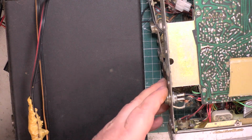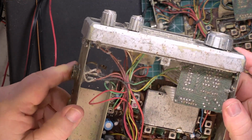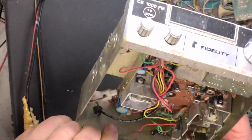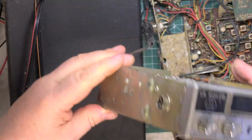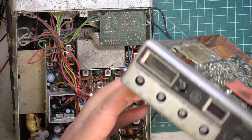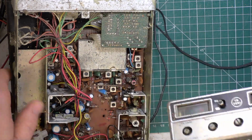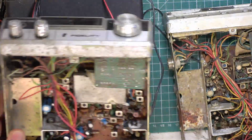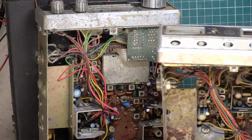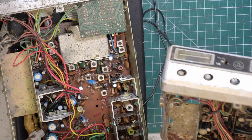We've also got here what looks to be a complete Fidelity 1000. Yeah, it's got a meter as well, and it's got the knobs, and it's got the wrong capacitor there. So that's something else we can have a look at today. And if there's time, I think Quotages came round with this, which uses the same chassis. This is the 868 version. These are the 848. The two-knob version of something else, like the Eurosonic, would be the 858, and then this is the 868 when you've got PA and dimmer. So they all use the same mic pinout, which is unique to these.